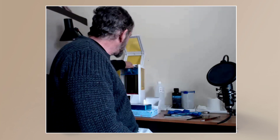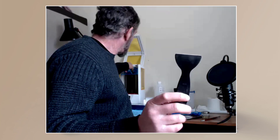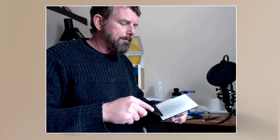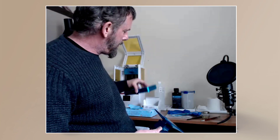Paintbrushes are really handy. People use metal scrapers on the build plate, but this plastic one that came with the Photon is brilliant — I don't need anything else. Metal scrapers can cause scoring on the surface, but with this plastic one it doesn't scratch and the print comes off nice and easily.